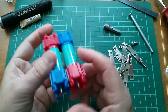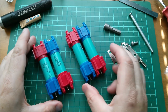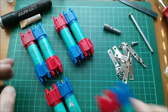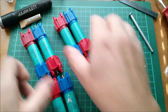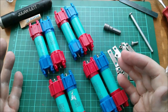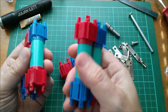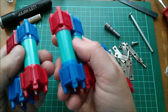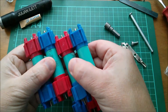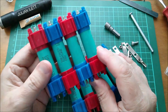I've got a strip across the back that holds this together. And in true Blue Peter style, here are some more that I made earlier, and they all conform to the same orientation — I've got my front dovetails top and right. In total I've got four of these, and you can see they've all got their strips attached on the back. Now this becomes quite fun because it becomes completely modular. I can show you now why you need to have slots opposite dovetails — this dovetail now slides into those slots, and this dovetail slides into these slots, and it happens simultaneously. So they just slide together.